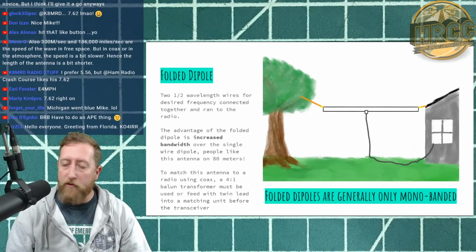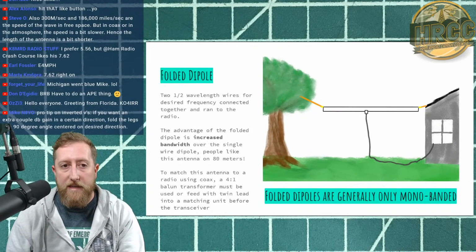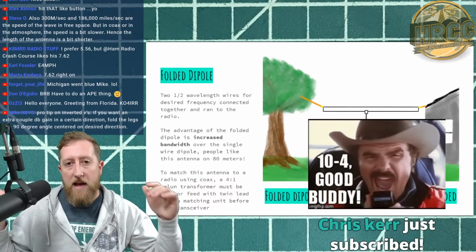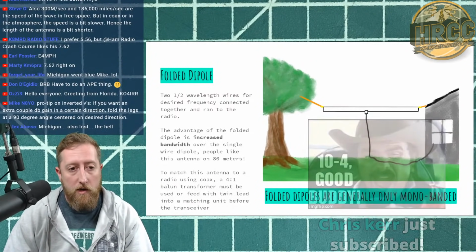The advantage of a folded dipole over a regular dipole or an inverted V is that it has a much increased bandwidth. And that bandwidth is something that you might want if you're on 80 meters or whatnot.